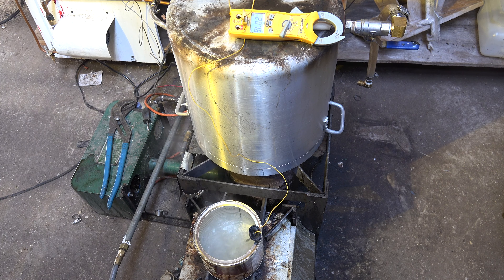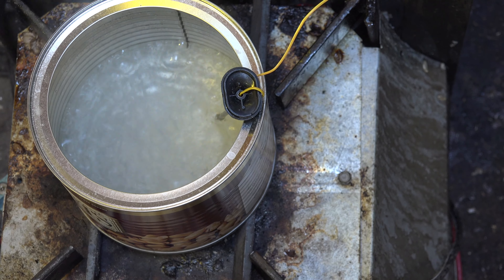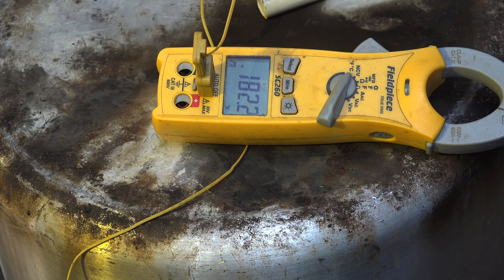We're about halfway down. Still holding at 207–206°F — the probe is still in the water but it is boiling down to about half. Now we're getting real low, not much water left. You'll notice the temperature of the probe is going down — that's normal when the water gets so low that most of the probe is out of the water, so it will actually read a little lower than the boiling temperature. But this is all going to change pretty quickly.